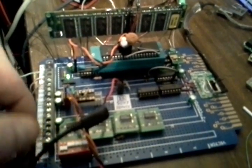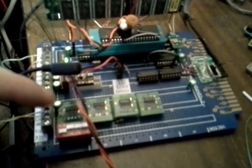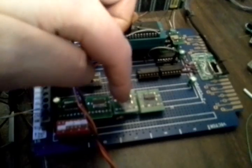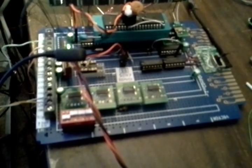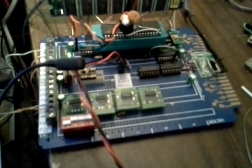So that's that. The next piece that I could explain is these guys down here. This is just a flip-flop. This is also a flip-flop, and this is an AND gate and an OR gate. Pretty simple. It's a one-shot circuit because the AVR can only go half as fast as the SDRAM. Those take pulses out of the AVR that are twice as wide as they should be and make them skinny enough for the SDRAM to interpret them.